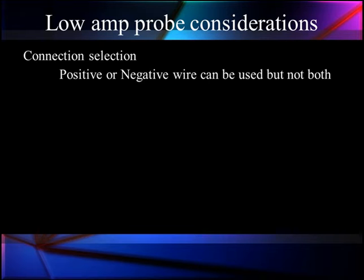Let's go back and remind you of something from our basic material. We showed you the right-hand rule: if you take your right hand and point your thumb in the direction of current flow, your fingers point in the direction of the lines of flux of the magnetic field around that wire. If I change from a negative to a positive, I'm going to change the direction of my thumb — one thumb pointing up, one thumb pointing down. The direction of the two magnetic fields are opposite.